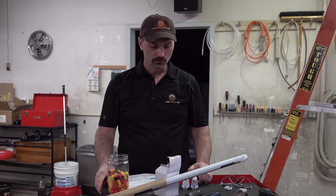If there's something you didn't understand in the instructions, we'll certainly be more clear in watching the video. Some basic tools we're going to need: wire cutters, side cutters, pliers, some type of wire stripper, likely a screwdriver to remove the cover once your old bulbs are out of the way, and possibly a nut driver to remove your ballast. We've also got some wire nuts here to connect our wiring. Safety glasses are a good idea at least initially until we get the old bulbs out of the way, just in case you happen to break one.